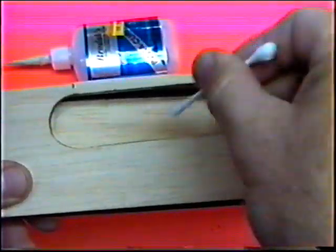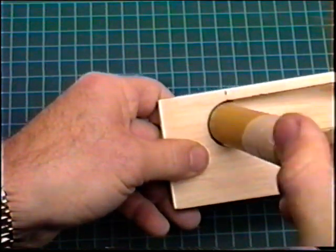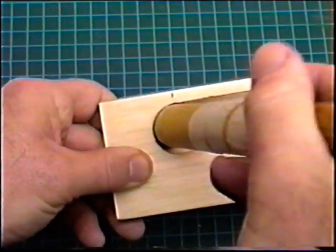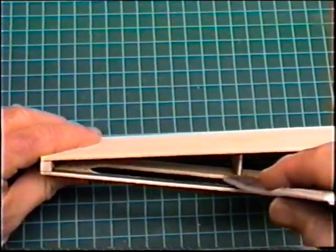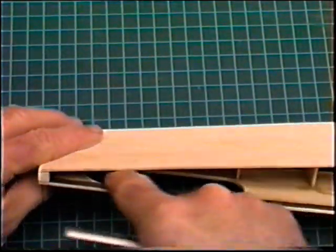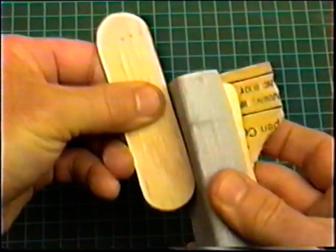As soon as you get that on there, ooh. What that does, that hardens that edge right up. Now I'll re-sand this out and I can work off that edge. Another nice use for these Bud McKnight sanding sticks, to get right in there and dress that edge off. Hard to imagine that there was a time when we worked without these things. I want to do the same thing on the edge on this with the thin CA. So I'm working with two relatively hard straight edges.